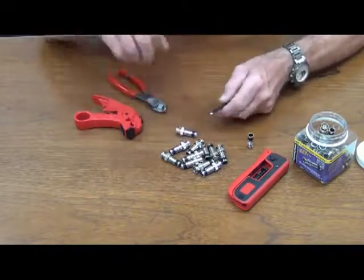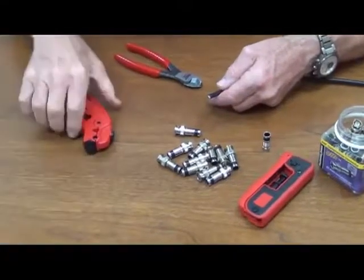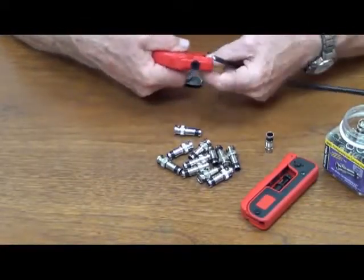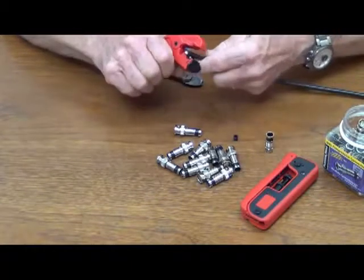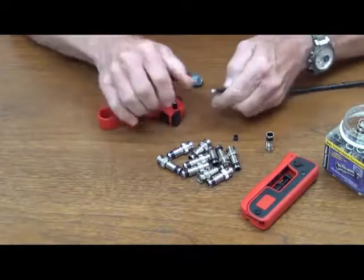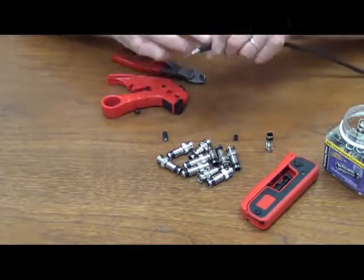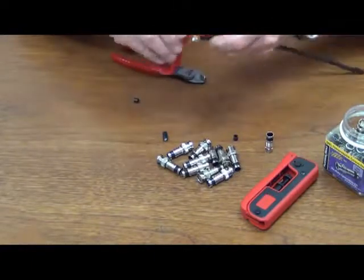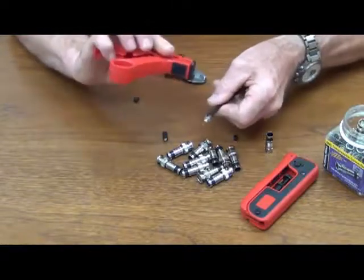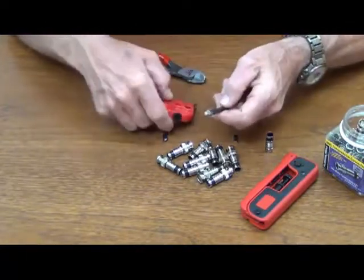But today we're doing RG6, so let's make sure that my cable's cut across the square. I'm using my big red stripper here for stripping the cable. Make sure it's cleared out of what's been stripped before, and just go around a couple times. Then we're going to comb that braid back — finish it with the Velcro. Big red comes with a Velcro comb, real handy, keeps the braid out of the fingers.